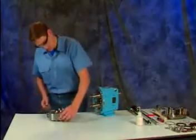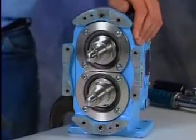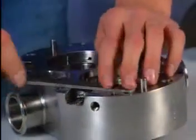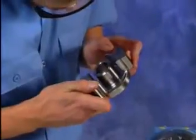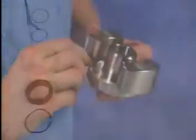Inspect the mating surfaces on the fluid end and the gear case for paint, rust, raised nicks, and other potential interference with a proper alignment. Clean or remove with a mill file if necessary. Any interference will affect the back face rotor clearances. Similarly, you should clean and inspect all fluid head parts.